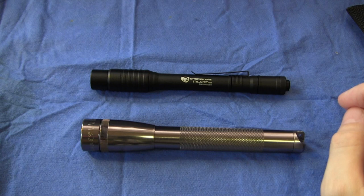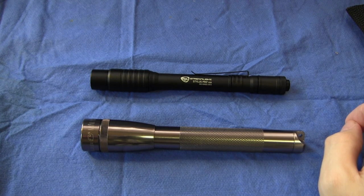Now let's have a look at some nighttime shots and beam comparisons. Here we are set up for our beam shot session. The camera is pointed at a pair of cabinet doors that are 5 feet or 1.56 meters across from edge to edge, and the camera is located 2 meters away from the doors. I chose a gray rather than white surface because gray is more neutral — white tends to wash out and give a false impression of brightness. The camera's focus is locked, the white balance has been set and locked, and exposure is locked at normal room lighting with a couple of fluorescent lights.